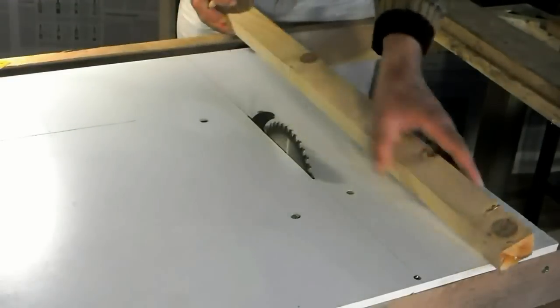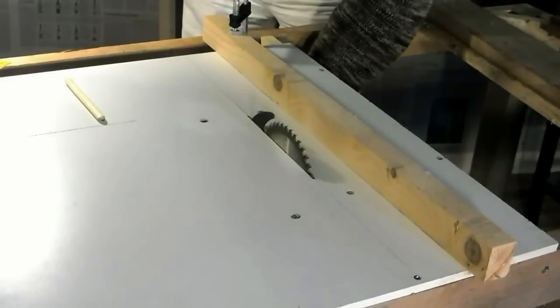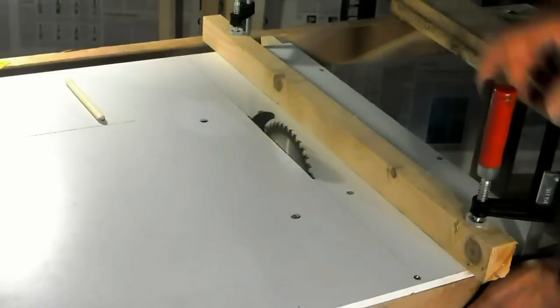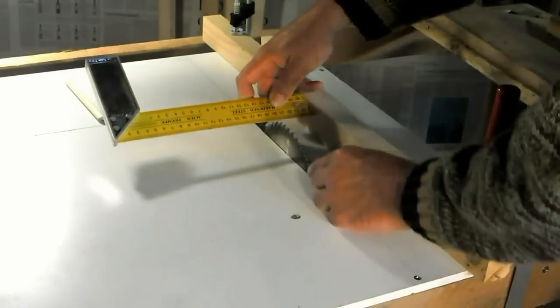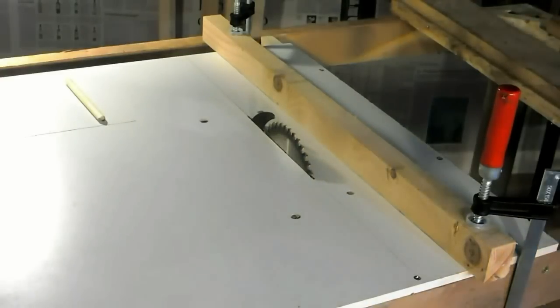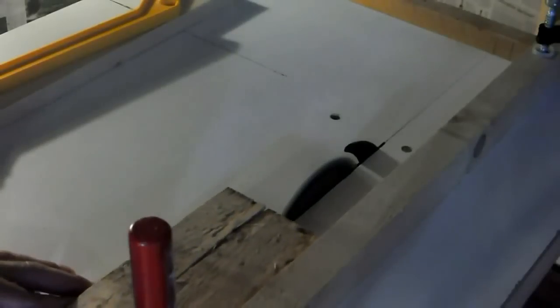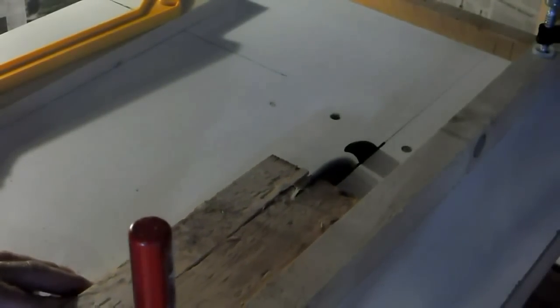So far, my fence will be that wooden bar clamped to the table. Now I have another fence. You can watch how I made it in my channel. I check the distance from the blade to the fence. I measure from the beginning and from the end of the blade. I will need a safety switch to turn on the saw. Now I can cut with my table saw, but I will need some pushers to work safe.